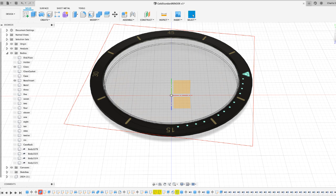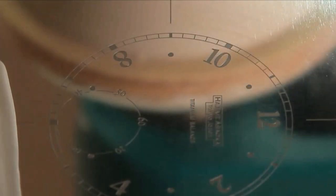With regards to the marker printing, well, we're using bicolor pad printing. Pad printing is a technique which is really common for any kind of precision printing where the target is either very small, and therefore the print needs to be precise, or it has unusual surfaces, as in they're either concave or convex. Pad printing looks a little bit like this, so this is the process we'll be using.